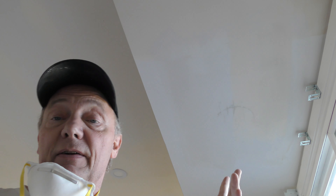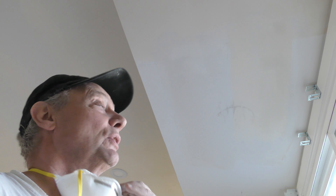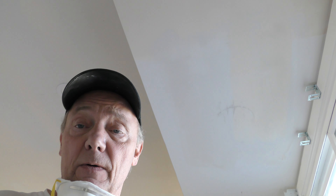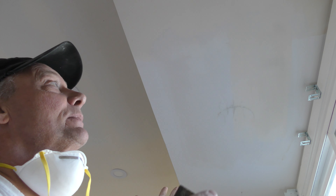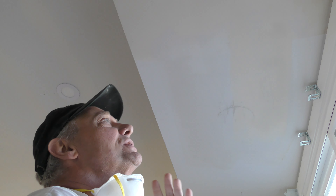It's all pretty much dry. I'm doing this patch in one shot. I don't know exactly how long I've been here, but I had some other things to do in here anyway and I didn't want to have to come back tomorrow. So I taped it, topped it, skimmed it, and now I'm going to sand it. A lot of people think you have to sand over the entire surface — not if you've made it nice and slick. You should just hit the edges.